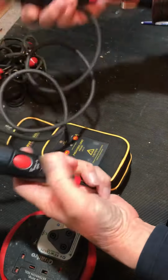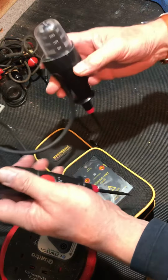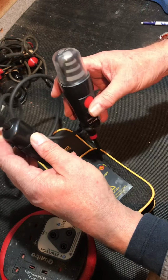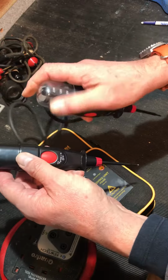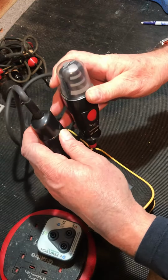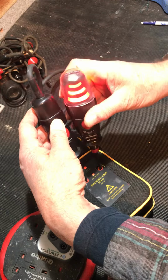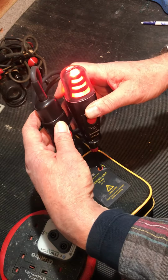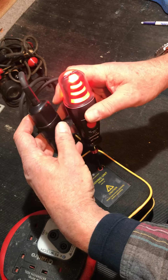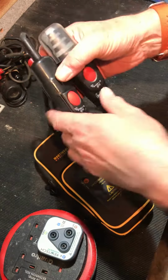This one you can do through the case, so the PD440 should turn out at least 440 volts. On a good set of batteries it's going to be closer to 490, so we will get all of these illuminated nice and bright, no denying what you've got there, even in bright sunlight. If I put those on, it puts a higher load and causes a low battery indicator on the unit because it's drawing far too much current through.